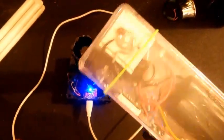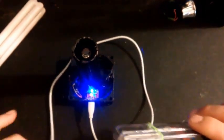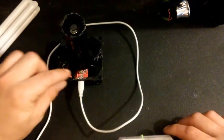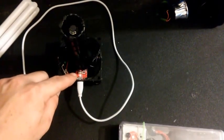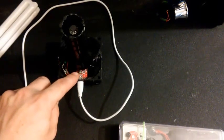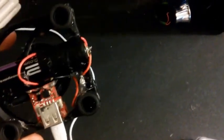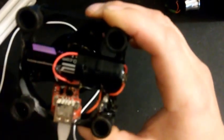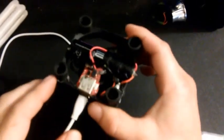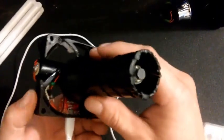The whole point of the USB is you can just recharge it. I've got a little power bank circuit I made here — same deal: I used the USB output and charge circuit from a USB power bank and just put more batteries in there and added a light. I'm going to plug this in to charge it — you can see while it's charging I've got these blinking lights. It's blinking four, which means it's almost fully charged, and after some time it'll go solid red to let me know it's fully charged. Essentially you've got your protected battery, USB circuit, your circuit straight to your battery, and then your tower straight to your battery through a switch — very simple.